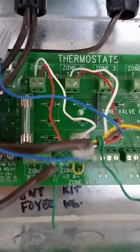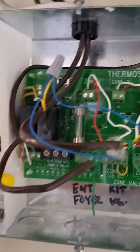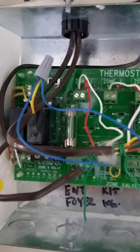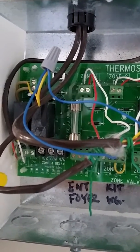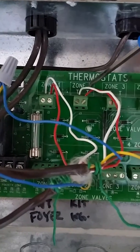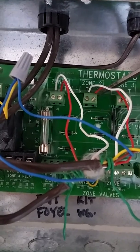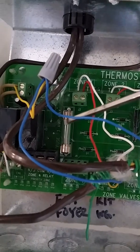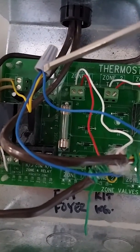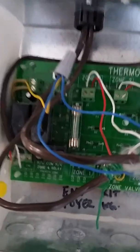Now what's the difference here — the thermostat I'm hooking up? I'm actually hooking up Nest thermostats to this. What I'm typically doing is I'm taking a power, I'm taking a neutral, and I'm taking a W heat call back from the thermostat. As you can see I set it up where from a Nest I have my heat call, I have my red or my power 24 volts, and then I came over and wire-nutted together my common and found it on this lug here on the top.